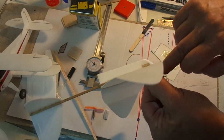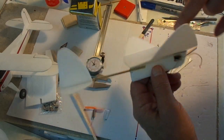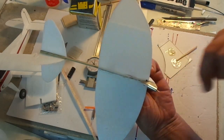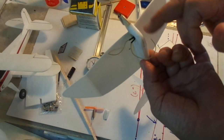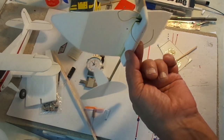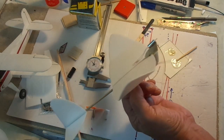By the way, the 5-minute epoxy cleans up real nice with denatured alcohol. I'm going to put the lightest little skim coat right on that wood too. Tiny bit there to hold on to that motor too. Alright, now that looks real good. There's no excess anywhere, and we're done with it quickly enough that it's got time to set up and have a nice smooth surface on the cured surface. So, making sure this is not going to stick to anything, I'm going to set it aside, let it cure, and I'll be back right after that. I'm afraid from here on in it's going to be a whole lot of short shots spliced together, so stand by for that. Epoxy cure time, go.